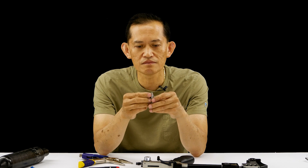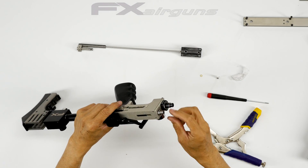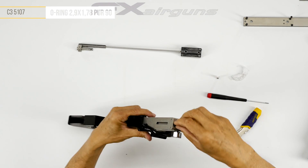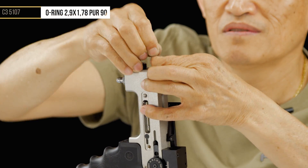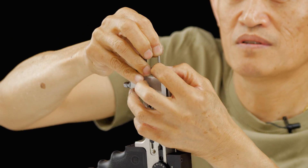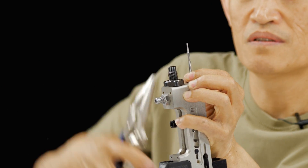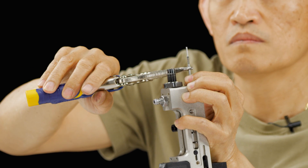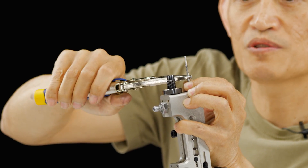Now I've got the spring and the hammer in. Next goes the little C3 bumper. We're going to clamp it — put the bumper right there and clamp it right above here. The reason for putting a vice grip here is because we're going to torque and lock-tight the hammer seat.